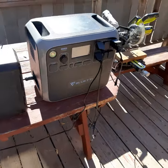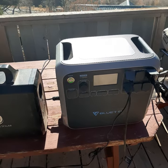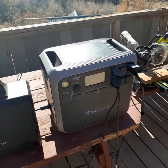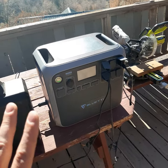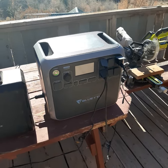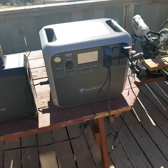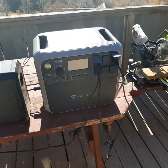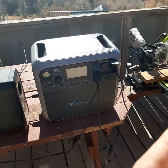This has a 1.7 kilowatt-hour lithium battery. The lithium batteries totally obsolete lead-acid batteries — their capabilities are orders of magnitude higher. Lead-acid was not capable of doing anything like running this saw or anywhere near 2,000 watts and still stay portable. So the lithium battery is absolutely key. We've also got the charge controller, the lithium batteries, and of course the 2,000-watt pure sine wave inverter.